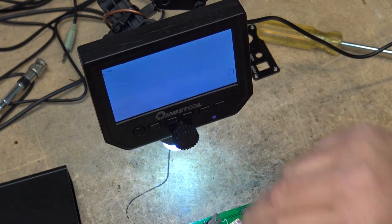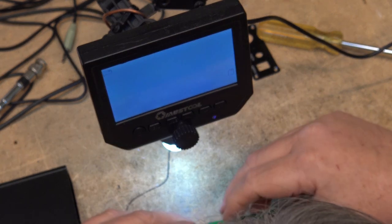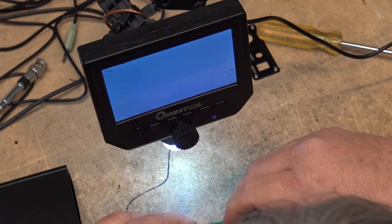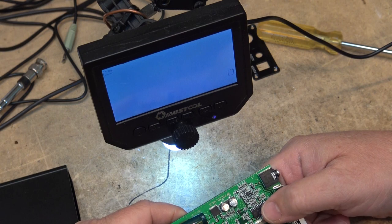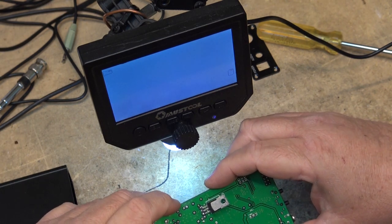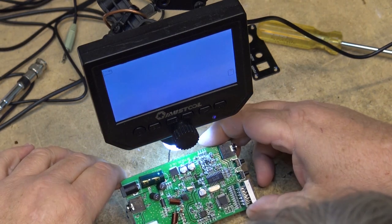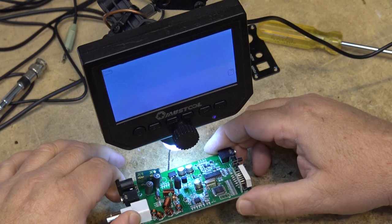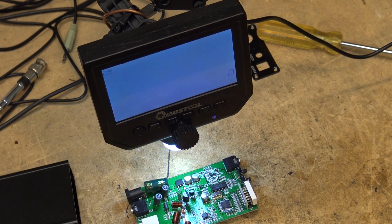Let's look up the 2SC1971 — it's an RF amplifier, and specifically it's a 6-watt RF amplifier. So what that means is this unit should put out 5 watts easily as they claim, although I think it probably should be heat-sinked. But I'm not worried about that because I'm not going to be putting this into service. I just got it sent to evaluate. It's going to go back into the box and sit in storage somewhere.